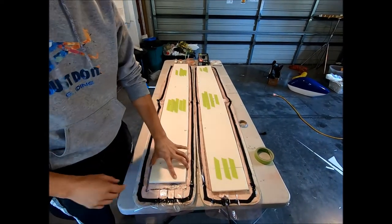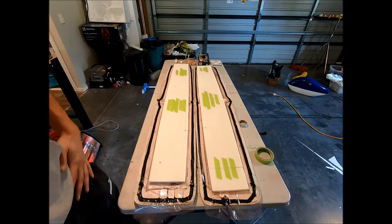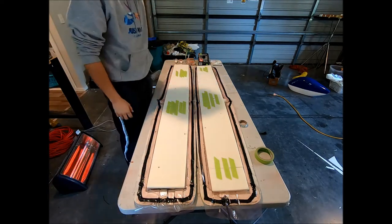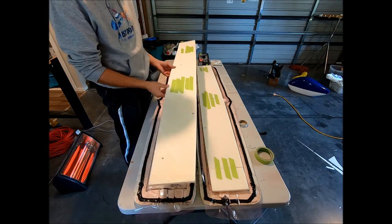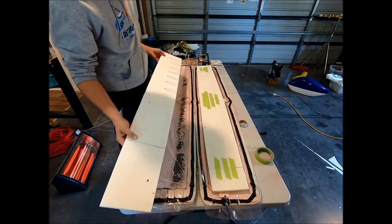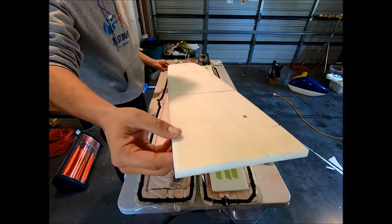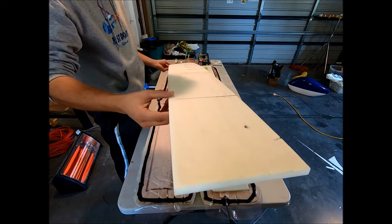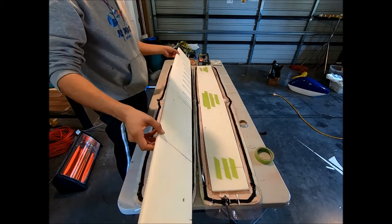Short by about 5mm at the leading edge. I've used multiple panels — haven't shaped long enough, but that's going to work for me hopefully. Then I've just sanded the leading edge slightly, giving it a bevel because the leading edge has a sharper radius than the rest of it. That just helps it conform to the shape.